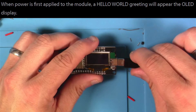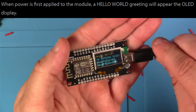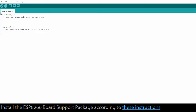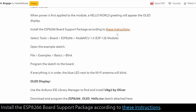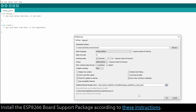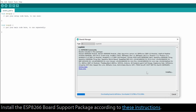So now we're going to mess with our NodeMCU ESP8266 OLED development board, and the first easy task is just to power it up with the USB cable. We should see this hello world, and it looks like that's showing up as expected. The next thing it's going to have you do is install ESP8266 support inside your Arduino environment if you don't have that already. There's a URL you need to grab from the link that's in the instructable. You're going to go to File > Preferences — there's a place that says additional board manager URLs and that's where you want to paste that URL.